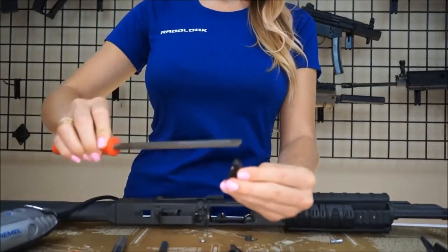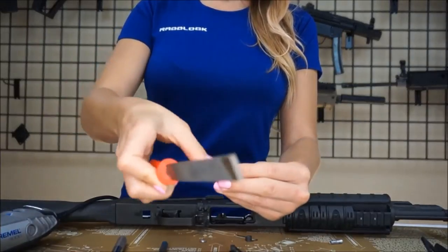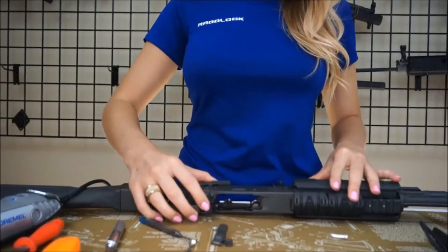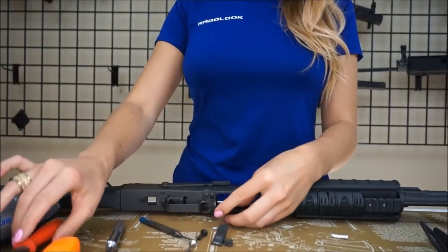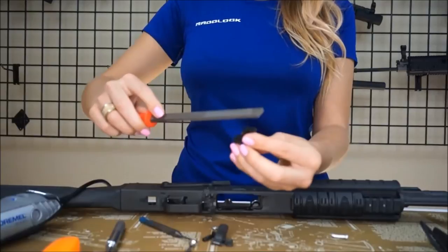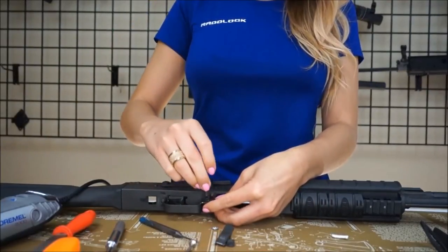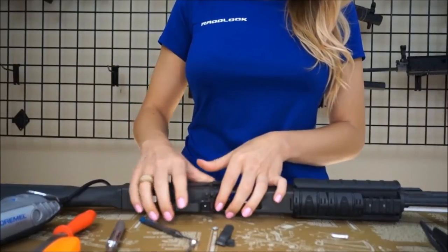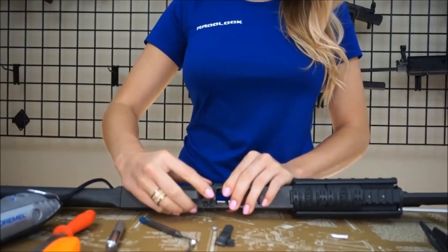Make sure you keep the top flat and level as much as possible as you remove the material. Then finish it to the mark with the hand file and put a slight radius at the front leading edge, so the corner is not too sharp. Next, you need to check the back side clearance of the AK RadLock by attaching it to your receiver with the pin only. Rock it back and forth to see if it is rotating freely. If it is tight, then use the rotary tool or the file to remove some of the material from the back.